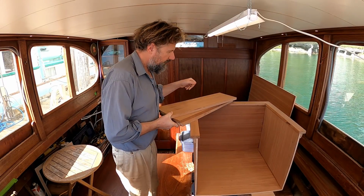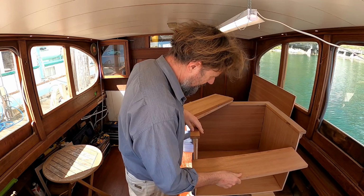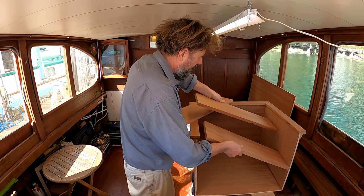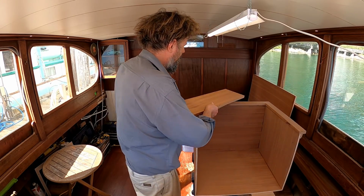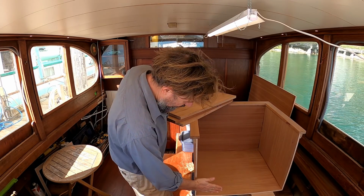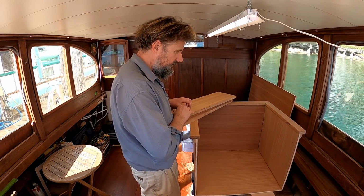All right, here we go. So we have the carcass and we have the material for the steps. Now they're already cut a bit too long because I have to trim them to fit, but basically they'll go there, there, and then one sits right in flush at the top. But before we make up the treads, I gotta make the risers, which is the vertical part that you kick with your toe when you're walking upstairs, and because they set in exactly where these are gonna set up.